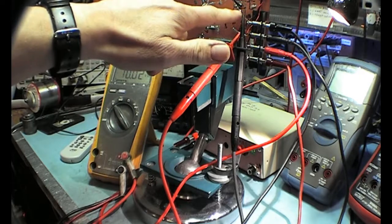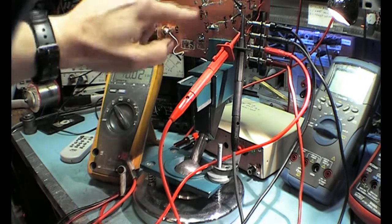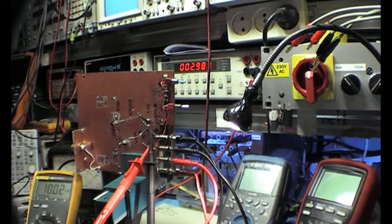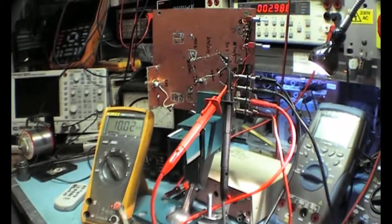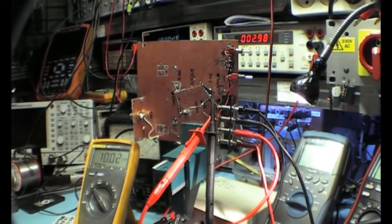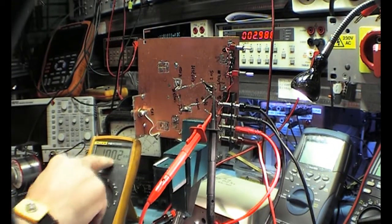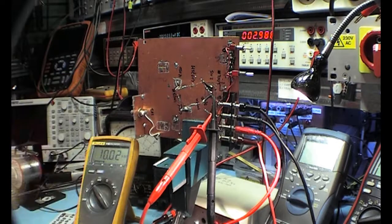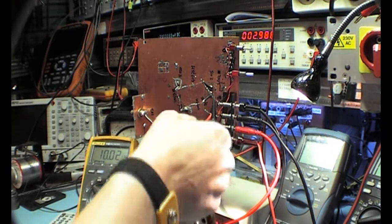You see the measurement goes wrong every step up, but then when you're at the last step, the error is almost gone. At least that is how it looks, because it's the 10 volt. But if you look at the current meter, it's now measuring almost 3 microamps instead of 2. So although the voltage here is not way off, the current in the circuit is way off. So things won't work the way they should work in this case.